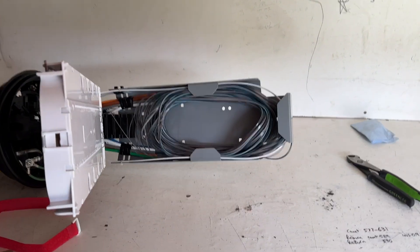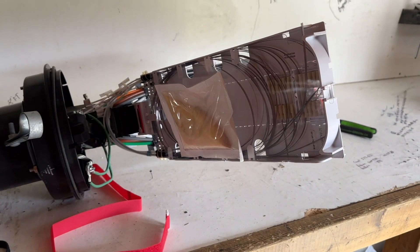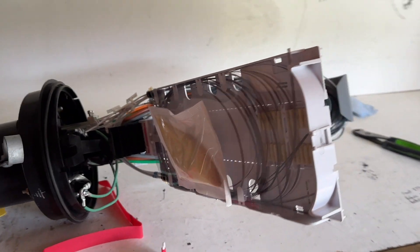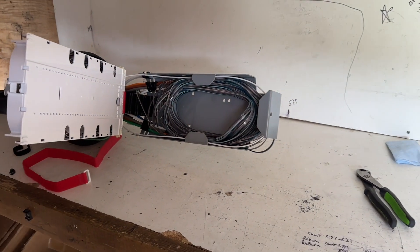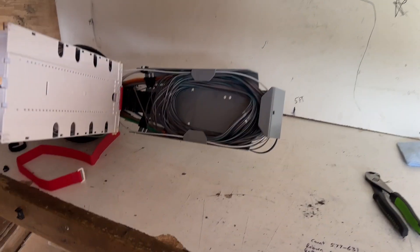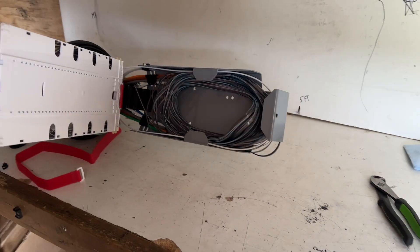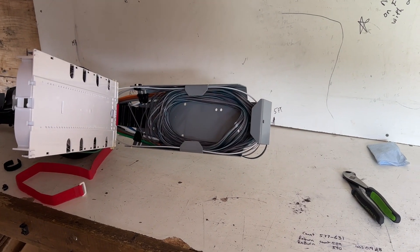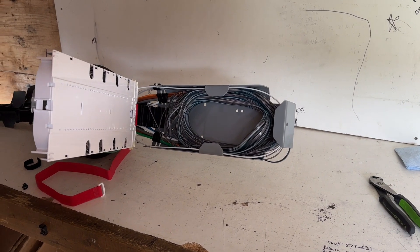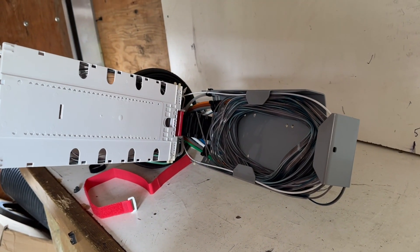I've been tying into the project over the last few days in the recent videos. This one's pretty messy and quite the chore. But this is fiber optics — when it comes to problem-solving things, the light should have made it all the way there. It didn't when I shot it; we only got 200 and some meters away from the cabinet. So I went and did some investigating, found this FOSC up on the line around that meter mark, and sure enough, here's our issue.